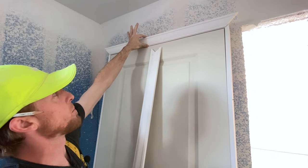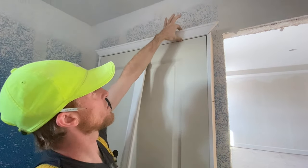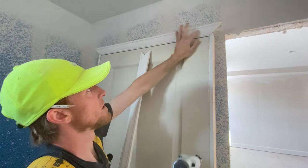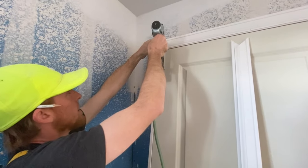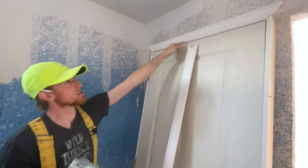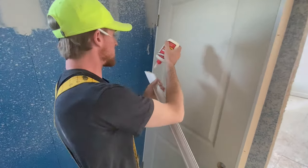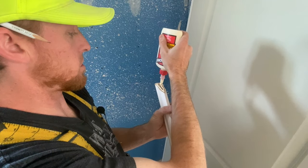I am rolling the casing just a little bit for this condition — it is Anderson. Just kind of rolling it back towards us, pushing and flexing it to get into the right reveal. Two shots over here. Now I need to come down to this side and do the same thing — rolling the casing, flexing it up to my 3/16ths. Two shots. So now that header is installed. Set the gun off to the side, grab both pieces, and we're going to throw a little bit of wood glue on top. Just a little bead on both — you don't want to overdo it. Don't want the glue to ooze out too much.